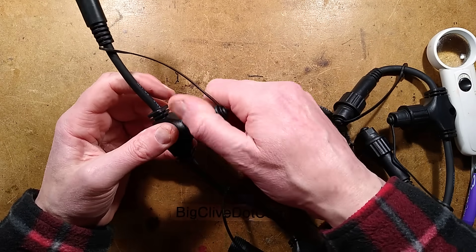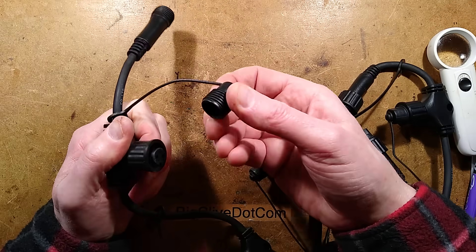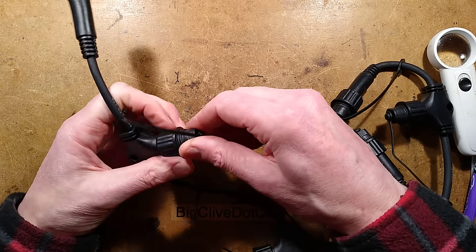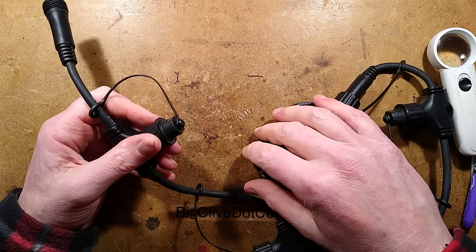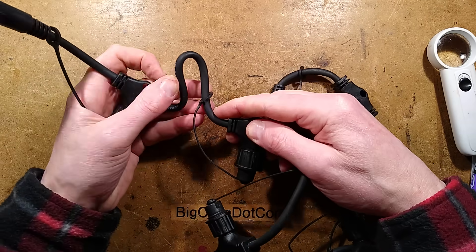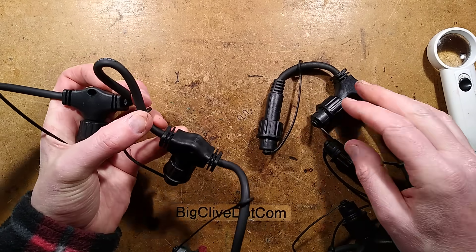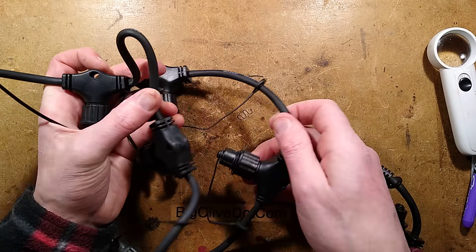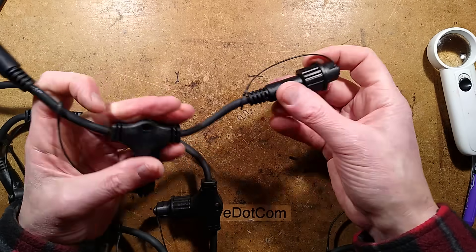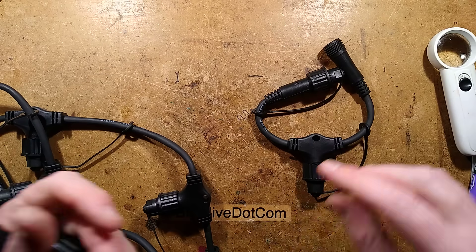Along the bus bar strip it's got loads of sockets, and you'll notice these little ties — these are just to make sure the caps don't get lost, so at the end of the season you can cap them up and keep things waterproof. If you want to fit a specific size, like we used to do between the banner drops in George Square, you get a closer spacing, or you can just put it up and cable-tie it onto the catenary at the top of the drop, then run all your strings down with a bit of support in the middle so they don't tangle. If you needed to extend it just a little bit more, you could add individual sockets end-to-end — power in, drop to a string of lights, and power out to the next section — making a custom loom. There's a lot of stuff available; it's quite versatile.